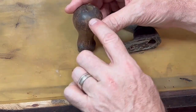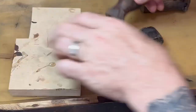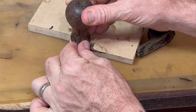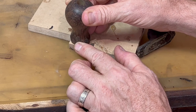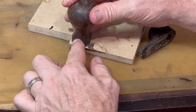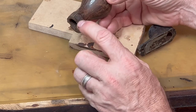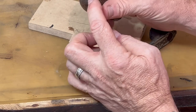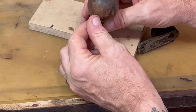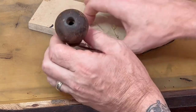It's solid, although it's really chewed up. We have some material to replace, and I'm going to do this in several steps. We're going to glue it to an MDF sled and make a table saw pass to get a nice flat surface. Then we'll glue rosewood on vertical grain with tinted epoxy, let that set, rotate it, do another table saw cut — probably three times on this one. We'll use the same material all the way around, shape it with a rasp, mount it on the lathe, dial it in for center, and turn it back to its original shape. We'll deal with the check, and the chew marks might be best left to give it that authentic aged look — repair the overall geometry and call it good.